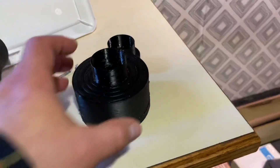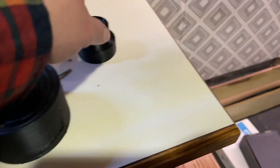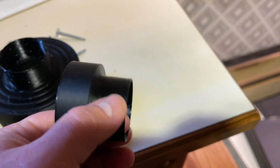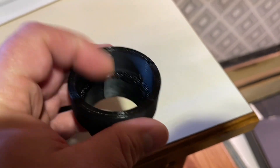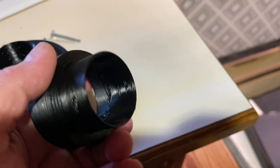I've got to cut a notch in here on the bandsaw on both sides to be able to slide that further on. I knew I might have to do that but I wanted to see how it was going to fit after I printed it — it's a really quick modification to make. This is kind of the same thing but for a single duct, and this is an adapter that will adapt the 40-millimeter heater duct to an ABS pipe so I can extend the run. I'm using some ABS to get the length I need.